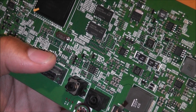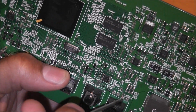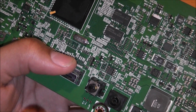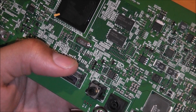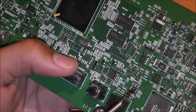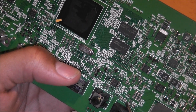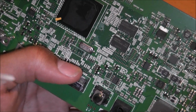Now the difficult decision here is, do I completely separate this rail there, so then the input is completely gone, and then I can wire, well, then I can have this as 240 volts in with the earth, and then wire the 14 volt live directly to those capacitors, or bridge them in between those capacitors there, and then that will supply 14 volts to this board.